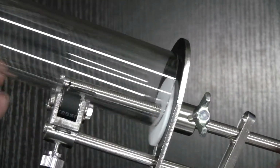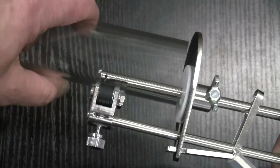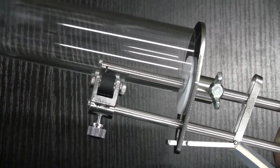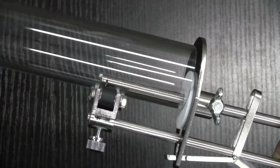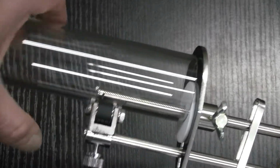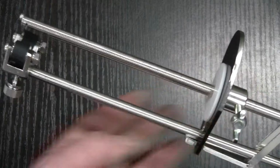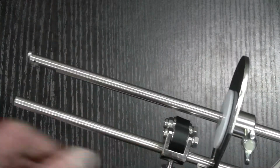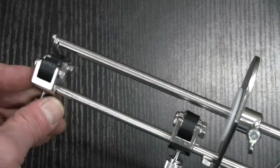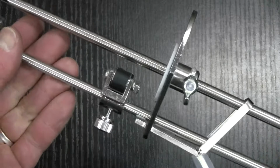3. Slide the tubing onto the cutting arm. Gently press the tubing end against the white wear plate. 4. Maintain slight pressure against the wear plate and gently compress the cutting handle while rotating the tube with your other hand to produce a very thin, shiny fracture line on the inside surface. The key to an accurate cut is gentle, consistent compression on the handle, consistent pressure against the wear plate, and consistent rotation of the tubing.